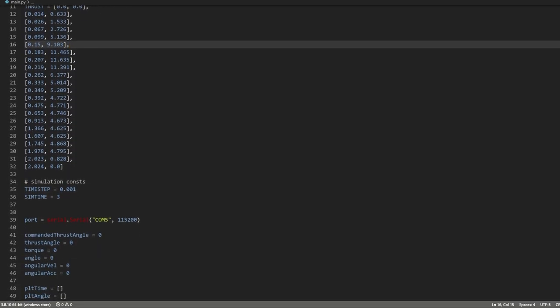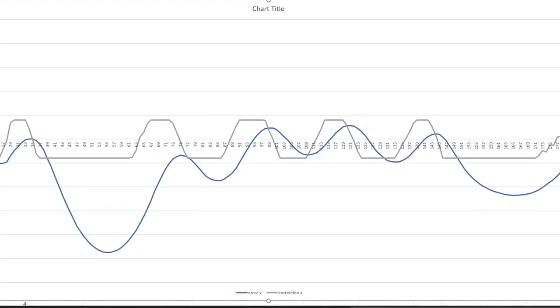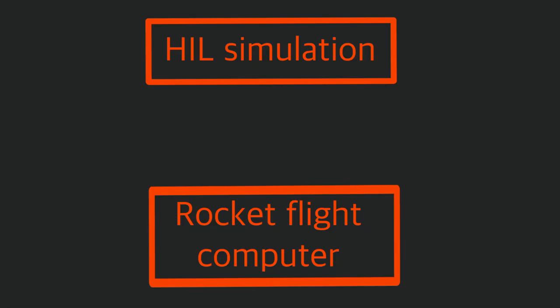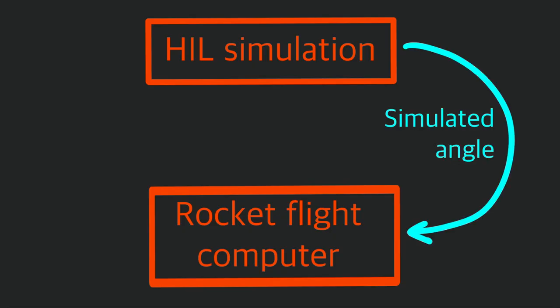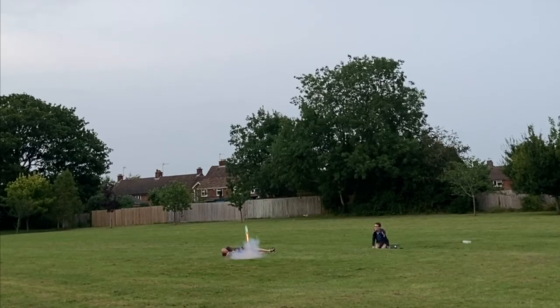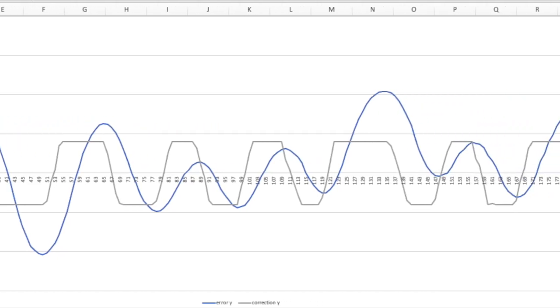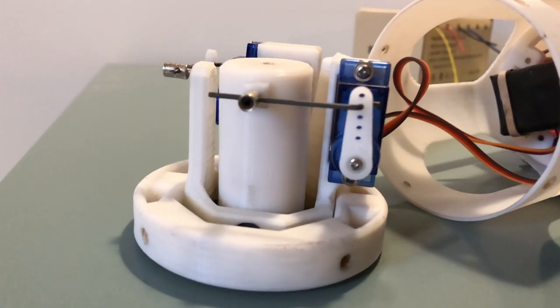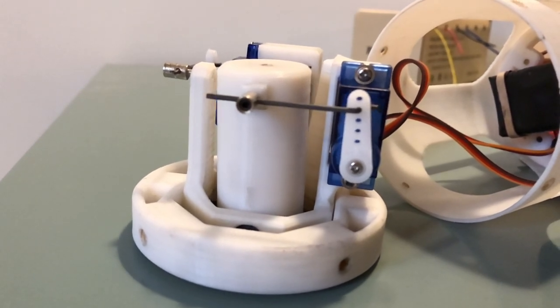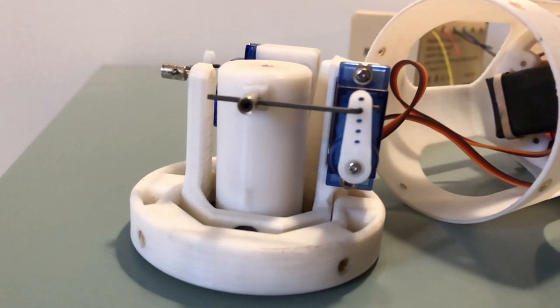To find these gains, I made a hardware-in-the-loop simulation in Python that simulates the angle of the rocket during its flight. It sends this angle to the rocket's flight computer, which sends back the commanded angle of the servos, closing the loop. However, the simulation is not perfect, as a clear oscillation can be seen during the rocket's flight. This is likely due to the servo motors not being properly characterised in the simulation, with their real speed being much slower than they were in the simulation.